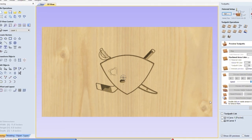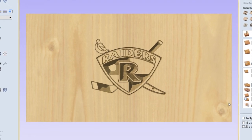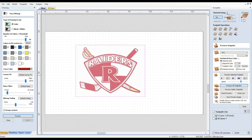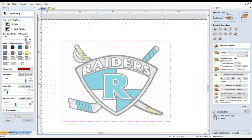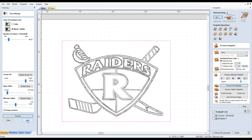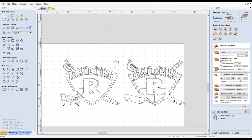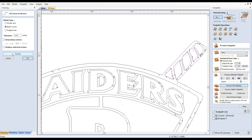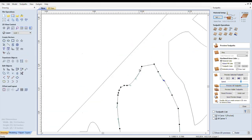As you can see here I'm getting a good start, but I'm missing some of the details in that hockey stick — some of the features of the tape on the bottom left and the handle on the top right. I'll speed this section up, but what I'm doing here is playing with some of the trace options, looking for a balance between all the detail I need and how clean my vectors are after the trace. I would try various settings, throw them into a v-carve and look at the quality of the carve in the render, then back up and try different settings. Based on the low quality of the actual logo I know I'm going to have to do quite a bit of cleanup on the vectors themselves.